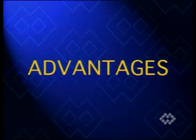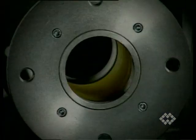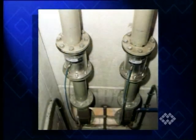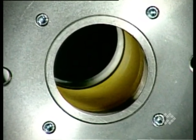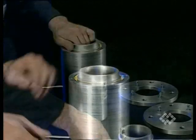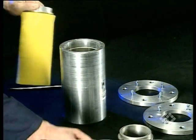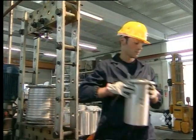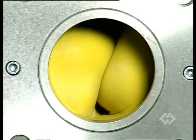The VM type pinch valves offer the following advantages: full bore through passage without any pressure loss, suitable for systems and plants requiring explosion proof line closure, no product contact with the body, and apart from periodic replacement of the sleeve with certain products handled, no maintenance required. Low weight in comparison with other makes and other valves, and particularly low air consumption.